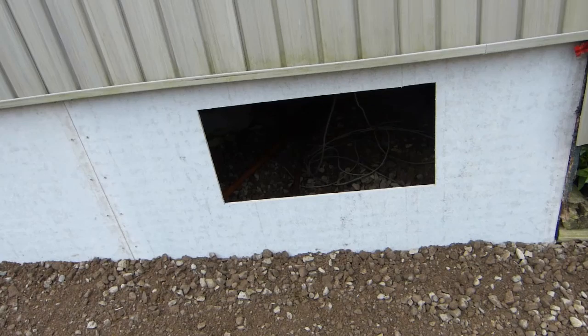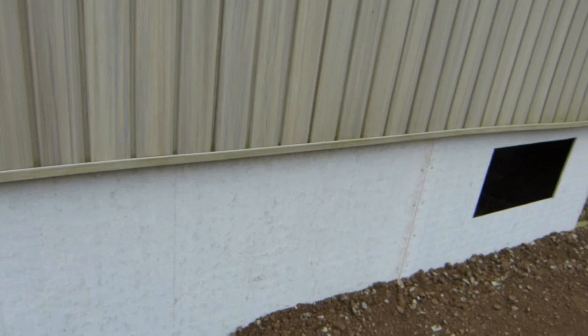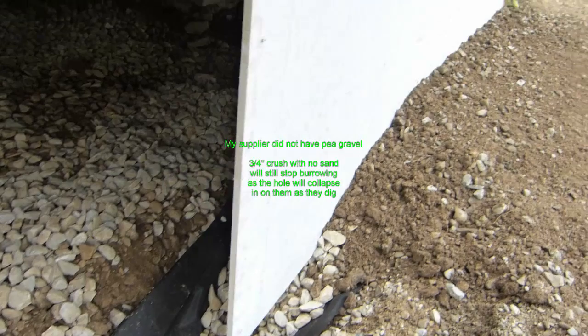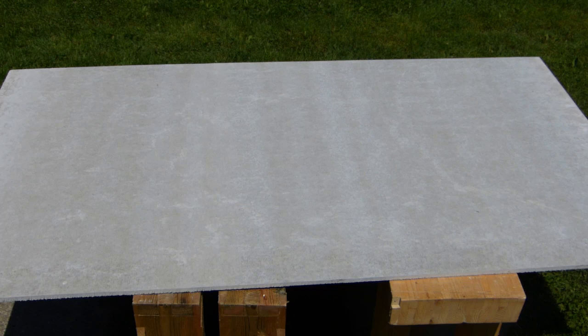This is starting to get leveled out a bit, and I'm doing down the edge of the driveway with the excess. There's my vent — it's 14 high by 28. I've got 32-inch wide panels and about a 28-inch exposure, so I've got four inches buried. Landscape fabric and three-quarter crush underneath, then gravel driveway on top. Inside there is a brace with a cross piece to hold it level, and three-quarter crush all the way in on the inside.